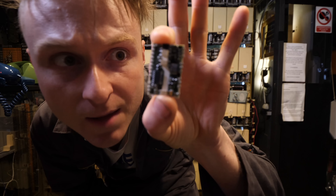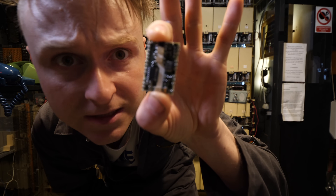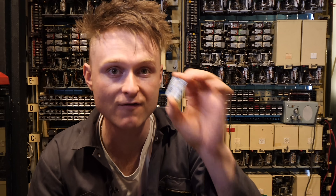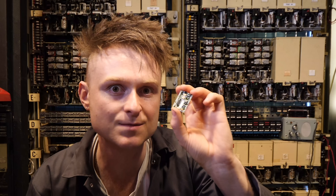The ultimate plan gives this the ability to have four separate calls coming in from around the world, as well as multiple calls being placed in the museum itself. It's going to be pretty funky. The next issue is getting the setup from Will to actually talk to the telephone exchange. It turns out to be quite simple — it's the MH88422-3. On here is a few opto isolators and a little mixer, with everything needed to plug the phone line in on one side and any audio source, computer, or synthesizer into the other side.